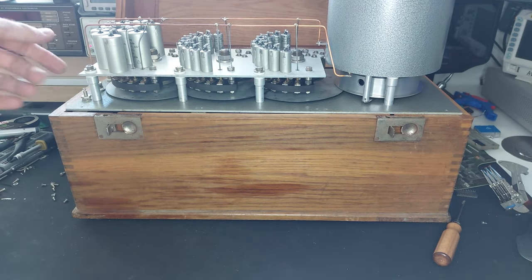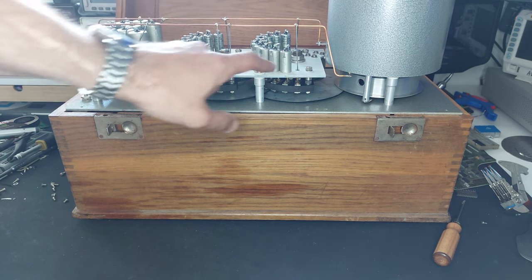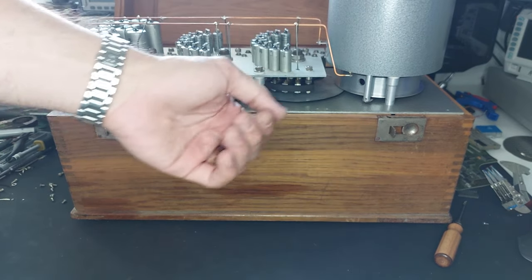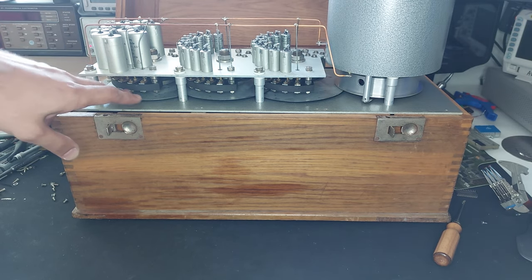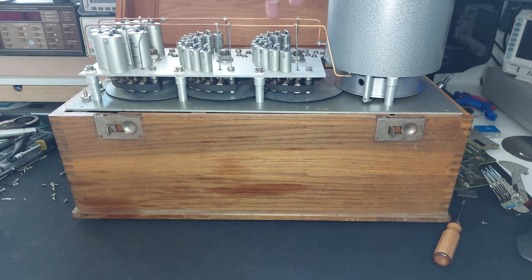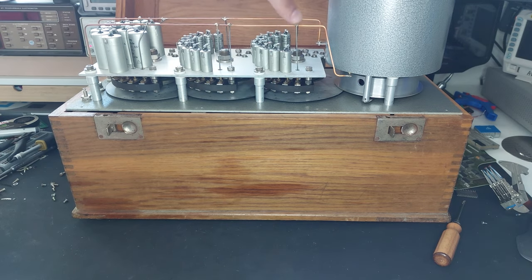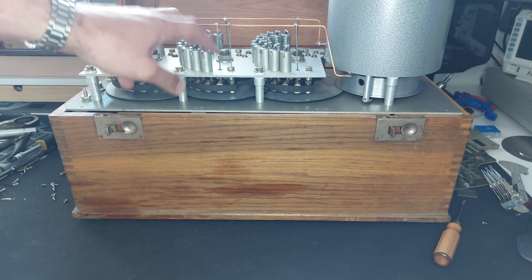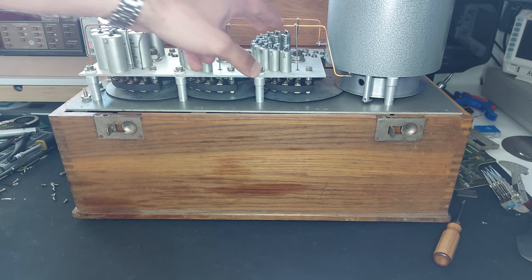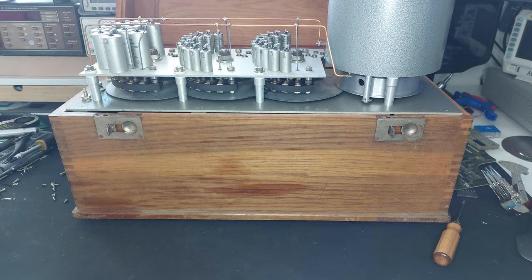And it's very simple. There are two bus bars, two thick copper traces, which tie each block in parallel, because capacitors add to each other when they're put in parallel. Each block itself puts a number of these capacitors in parallel, from just one or none, so completely disconnected, to more and more. So you can have 10 100 nanofarad capacitors in parallel, then another 10 of 10 nanofarad, and then 10 of 1 nanofarad in parallel. And this is always connected.